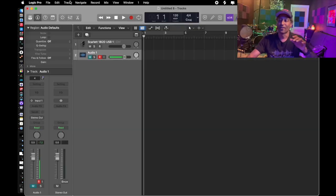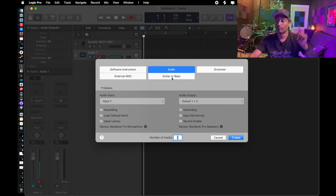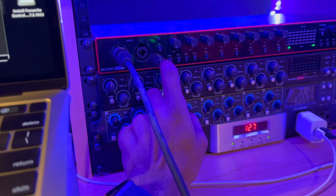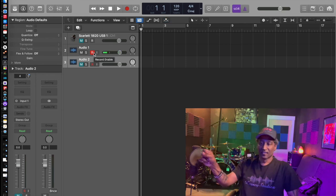After doing a software update on the Focusrite control, I finally got things to work. Let's create a new track in Logic — make things simple. No shortcuts or key commands. Go to Track > New Tracks. We have a selection of software instrument, external MIDI, guitar, bass, drummer. Let's do audio, input one. This microphone is a condenser microphone — its internal components are very sensitive and it lacks a little power. We need to add phantom power, which may show on your interface as plus 48 volts. While it's not built into the software, it is built into the hardware on the interface. Let's push that button.